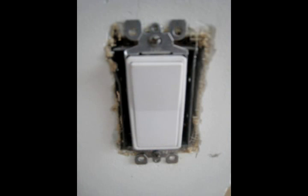So basically, remember, you're just connecting the white wires. They have no connection with the actual light switch. The only wires that are touching the switch are the live ones, the black ones, and each black one gets connected to its respective brass screw, which gets tightened in, and the white wires are just connected together. And when you're done, you can put a nice looking cover plate over that so it looks a little bit nicer, and that's all there is to it.